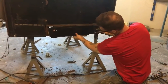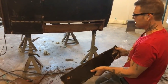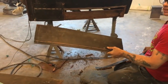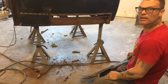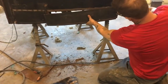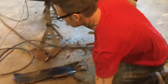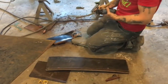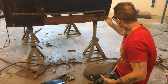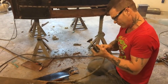Yeah, so we got the bottom of the door ripped off — we got it cut off with a plasma cutter, not a grinder. I'm trying to do this quickly and reasonably and get it done. Had a hard time — there was some tar inside. There's another panel that we made — made it out of paper, me and my little helper Sparkles. I'm just going to fit this up now, slide it up on there and tack it on the front to see how it fits. To get these skins off, what I usually do is just cut the edge, take the grinder, grind that edge off, and they usually pull right off. That's the way I do it.